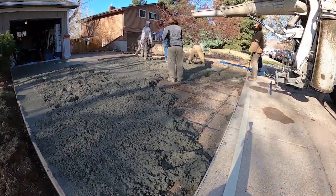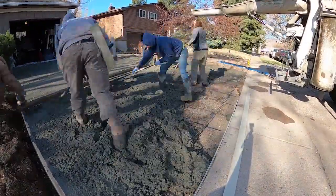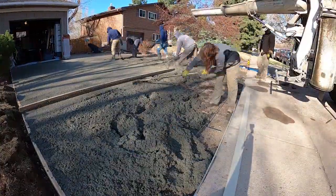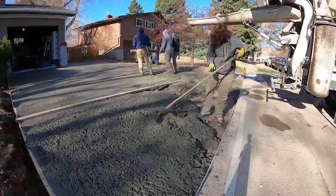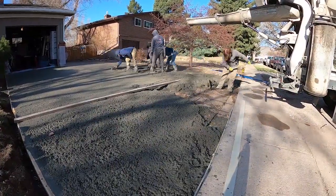And you saw there when concrete was coming down the chute, we pour about a 3.5, 4 slump for driveways. We like minimizing shrinkage. We know that cars do have salt on them when they're driving on these Colorado roads. We want to minimize any possibility of any flaking, spalling, scaling. But it makes it a little harder to work. I mean, the guys aren't happy.